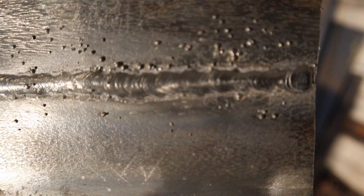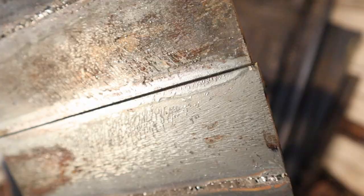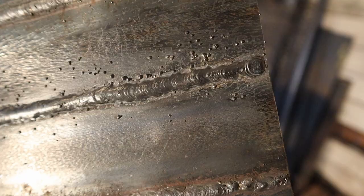It may not be the prettiest weld, but it's a lot better than a weld that was dragged straight along. That weaving allowed the metal to melt both of the plates and fuse them together properly. The weld didn't go all the way through the plate, but if you're welding something that needs to be structurally sound, you could take an angle grinder, grind a groove into the back of the weld, and put another weld in the back of it.